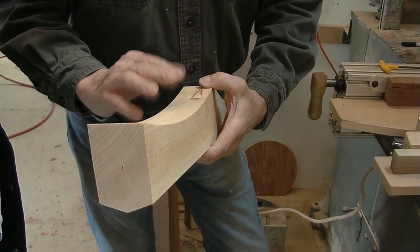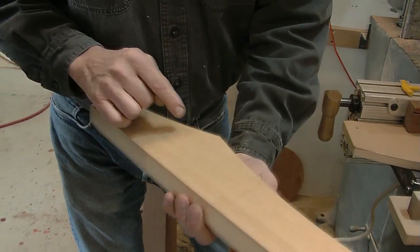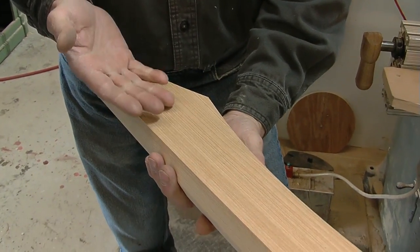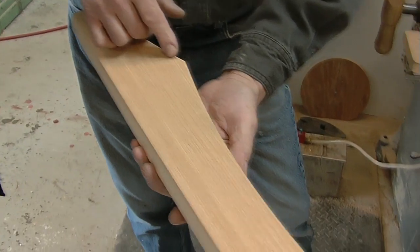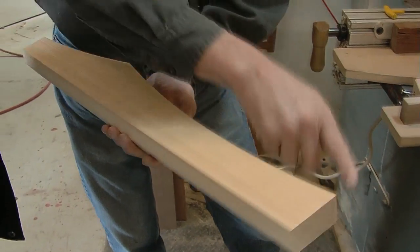I've started to do a lot of template sawing because we get into situations like this with a wood like cypress. If you run in with a router, one end of this or the other, no matter which way you cut it, you're cutting against the grain, and it'll chip out here or it'll chip out here. The thing is, people think of bandsawing as not being quite as precise as template routing. But template routing doesn't get you quite ready for a finish. You still have to sand.